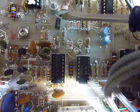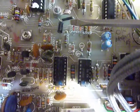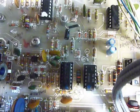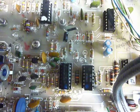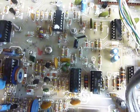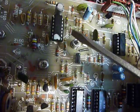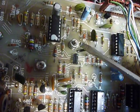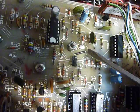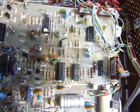What that does is it increases your hang time on CW, so when you're working CW the relay is not clacking constantly every time you push the key. It'll stay in transmit longer, and you can adjust that with your CW VOX control on the front panel. So it's a little ground lug, an extra nut to hold it on, a 2.2 microfarad capacitor with insulation sleeving, and a little hook to the end of that diode — and that extends your hang time on CW.